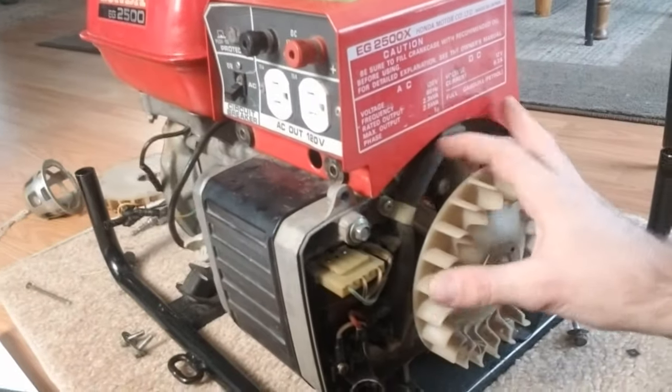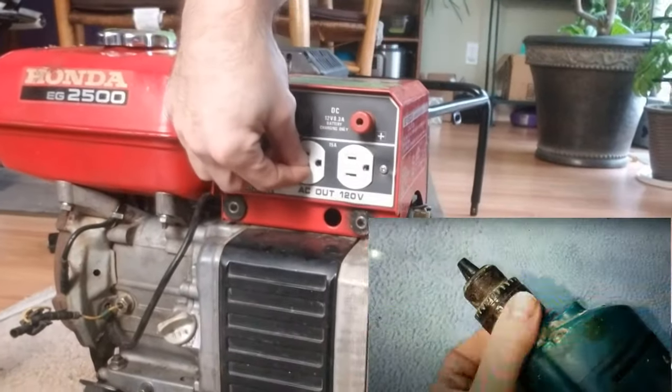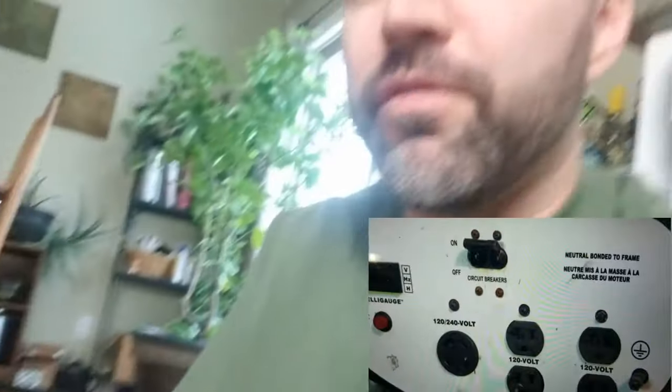The next reason — I've never had it happen to me or any of the generators I've worked on over the years — but your generator might lose its residual magnetism within the motor. I'll put a link in the description to Steve's Small Engine Saloon and Repair on how to flash the field with a corded drill. You basically have the generator running, plug the cord into the outlet, remove the bit from the chuck, set the drill to forward, hold the trigger down, and then flick the chuck counterclockwise with your other hand. You only have to do that a couple times and it should flash the field with electromagnetic pulses and get everything up and running again.